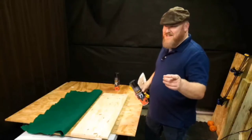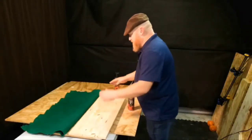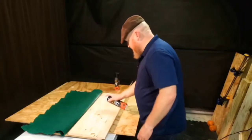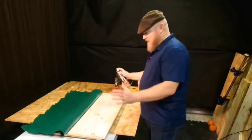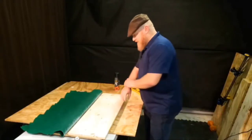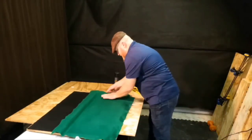I'm going to shoot this piece then shut everything down, open the garage door, and finish it out with plenty of ventilation. You've got to be careful of overspray — you don't want to get glue on anything you don't want glue on because it does tend to stick around for a while. This comes out in a nice flat spray. I've already got my felt ready to go and folded back. I took an iron to it and got all the creases from where I had it folded up for storage. We're going to lay that over — it does tend to stick up real quick so get it down.